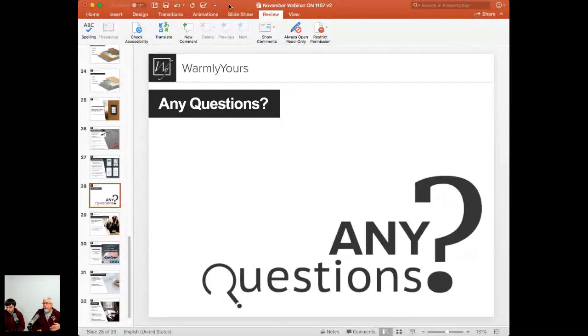But now we know that a lot of companies are making products that have an R value. So the first question we're always going to ask is, what's the R value of the flooring? If the R value is R1 or less, sure, go ahead and use it, because no matter what it's made of, as long as it has an R value of 1 or less, that's a good combination. If you have a product that has an R value of 3, you don't want to heat that.